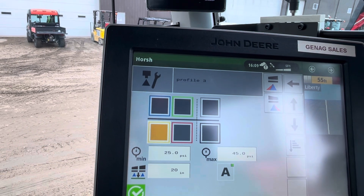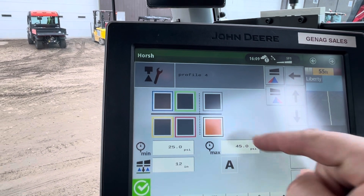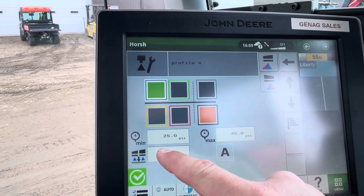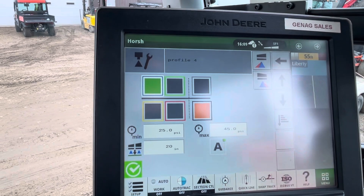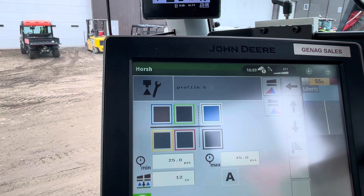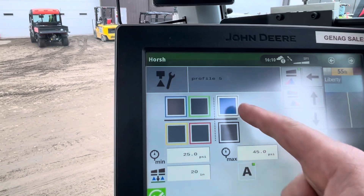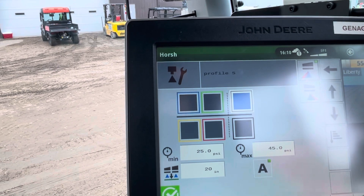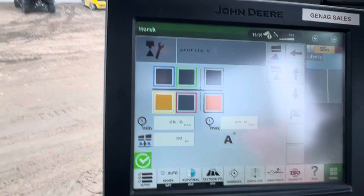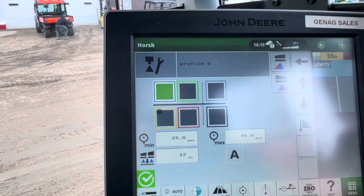The next size up will be a 1.5 plus a 1, which gives us a 2.5 size. We'll turn on the O1 orange and the 1.5 green to get a 2.5 size. Now we're looking for a three, so we'll go up one more. In this case I could pick a blue three, but I want to make sure I'm on 10-inch spacing, so I'll turn off the blue three, turn on an O1 orange and an O2 yellow — a two plus a one gives us three. Next is 3.5, which is a green 1.5 plus a yellow two.